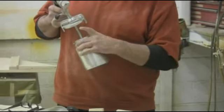All right. Now, the last thing I want to tell you guys, when we get about this painted surface, even if you brush paint this, or use a pad or whatever, scuffing it in between coats is key. If you get brush marks, it isn't going to hurt anything in here at all. But the final thing, scuff it down, throw a good coat of wax on there, and it will feel really nice and smooth. Again, even if you just use a latex paint, just be particular in your painting.